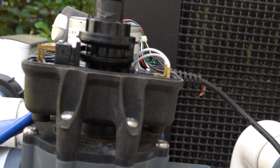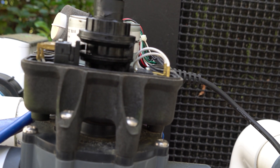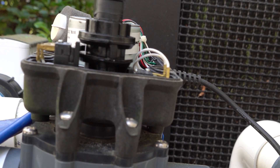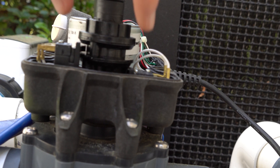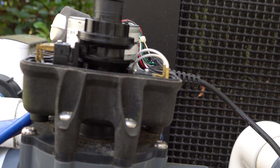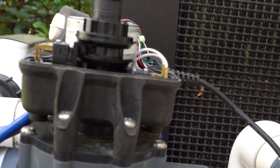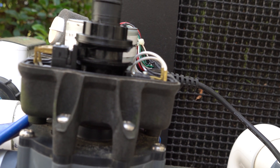In my case the pool is the default, so my switch stays in the up position — when the pool equipment turns off it defaults back to pool mode. We saved about $148 here by just replacing these two limit switches that had gone bad. That doesn't mean it's a poor quality part; it can actually mean they don't get used enough, and staying in one position for a long time can cause them to fail. The good news is we can replace them without replacing the whole unit, because the unit is expensive.